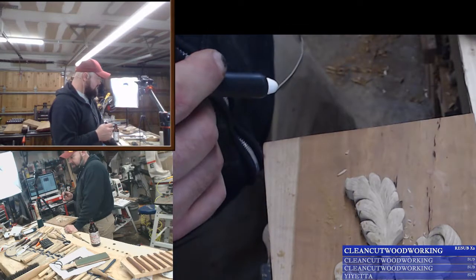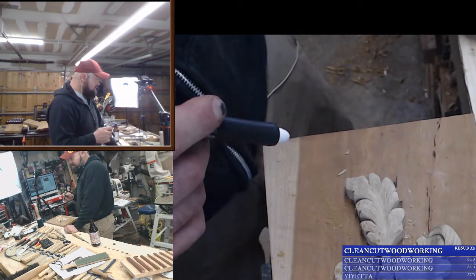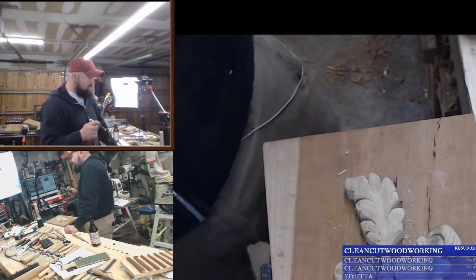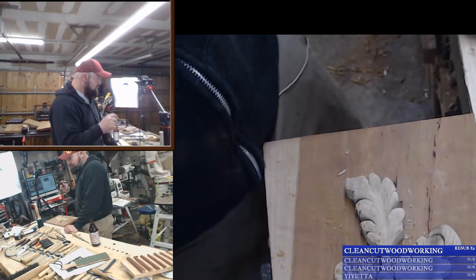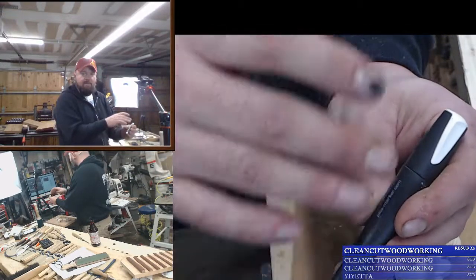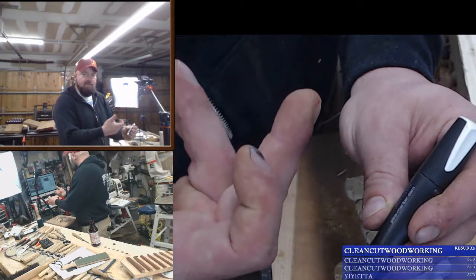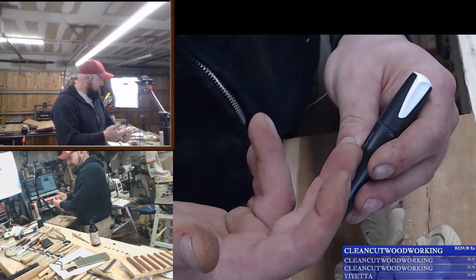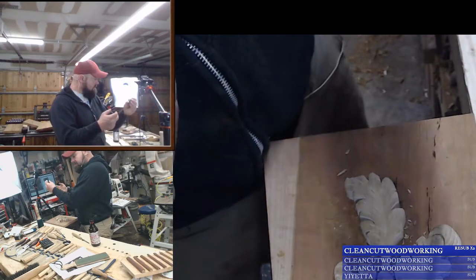getting downhill from what I've been explaining, uphill would be into the grain. So cutting downhill, I've never referred to it as that, but this is my guess. If you're cutting downhill, that's going with the grain. You don't want to cut uphill, because it'll be the same thing. The grain's going this way. If it's going this way, that would mean downhill for me. But if someone says, oh, try to cut it uphill and go this way, you get a huge gouge. So that's why block planes are block planes. Chip breakers are there. They don't break the chip. They stop the blade from digging in.